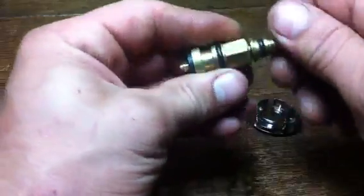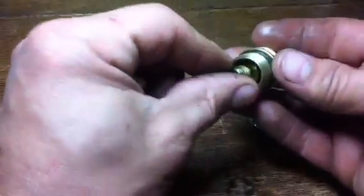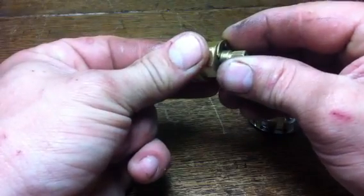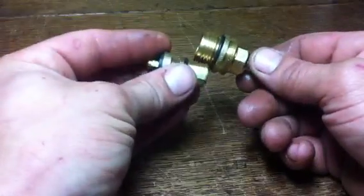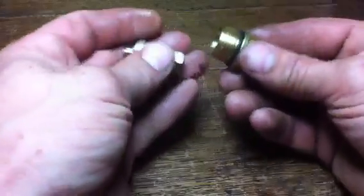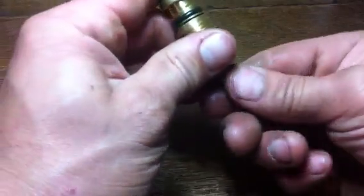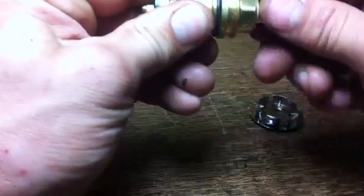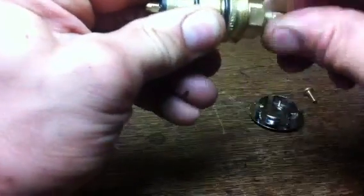Then, with those two together or separate, slide it back in. We'll do it separate because that's the harder way to do it. That goes up there, in there, and then your circlip goes back on. By the way, if you have to pull up on your tap heads, that's because this little washer has gone, and when you're unscrewing, it's not actually lifting the washer. What it's doing is this is just falling down into it. Now you put that on top like that, and then you can unscrew it up. Now these aren't the easiest thing to do because you need to turn it to the right position so that it slides up. That's why the easiest thing is putting them up through together, and there it is, it's in.